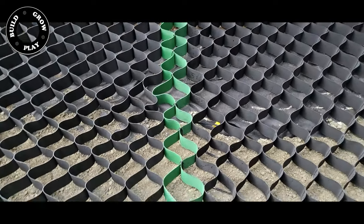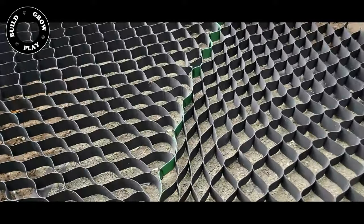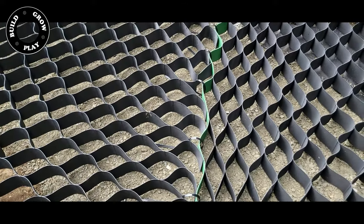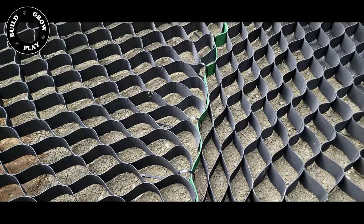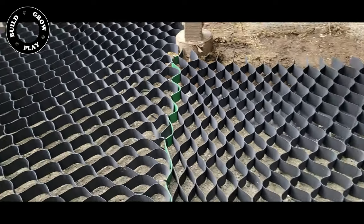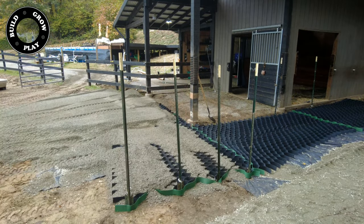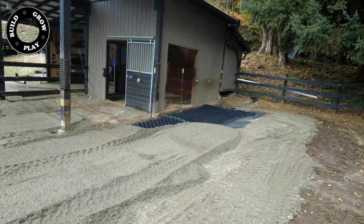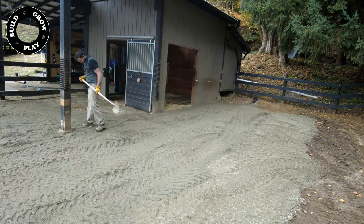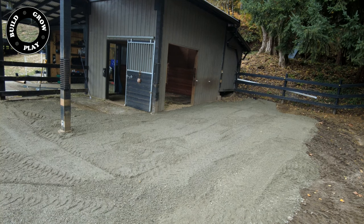This should minimize the zip ties being broken by a stray horse hoof. The matrices also join together quite well perpendicularly, however I've made a point not to tighten the zip ties too tight along this join simply to allow for a little more movement as I'm pouring the gravel. I reckon you need at least eight to ten stakes per panel if you're planning this job out, and spread the gravel evenly and light at first so as not to deform the matrices as you are pouring.